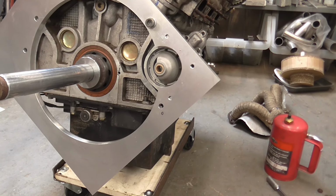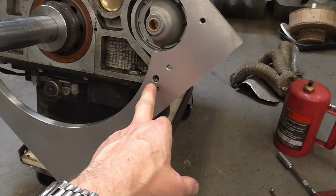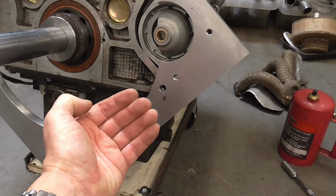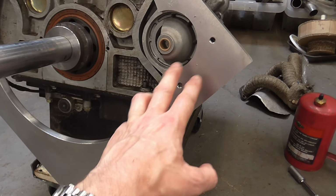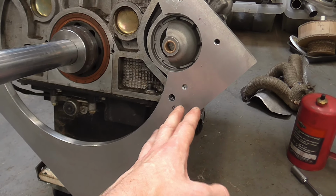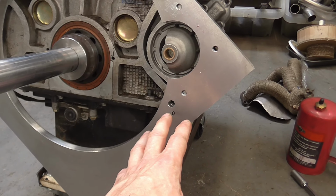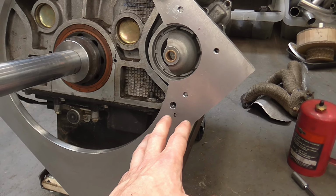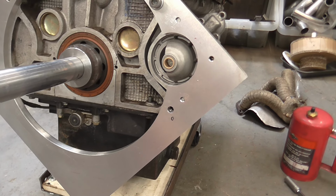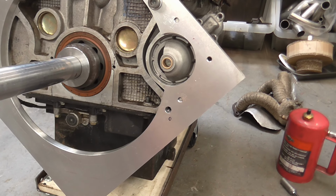So I do have a little problem to solve with this particular bolt location. This has got the locating dowel behind it, so it's counterbored, and also the bell housing sits above it, so it would need to have a countersunk head or a bolt coming through from behind into a thread. There isn't really enough thickness of plate left because of the counterbore for the dowel to put a thread in there, and at the stage I was making those location holes, I forgot about it anyway.